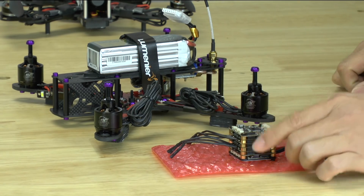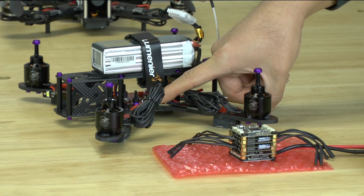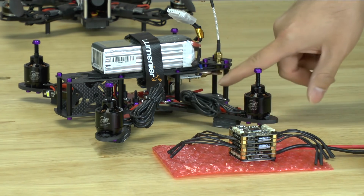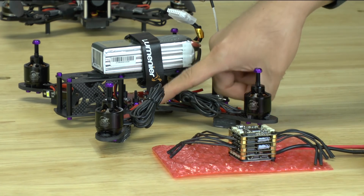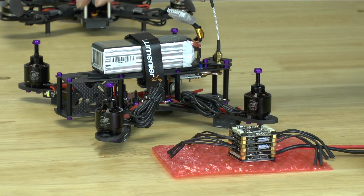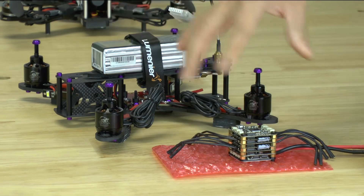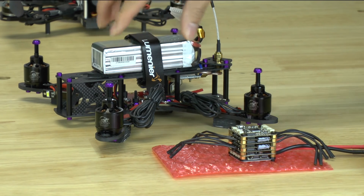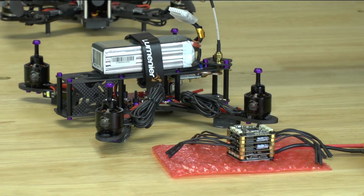We're going to go ahead and put it in this quad and make a few modifications. The 12 volt power — we're actually going to run 12 volt power to this power distribution board. By doing that we have plenty of clean 12 volt power to power things like LEDs and our video transmitters. We're actually not going to use the 5 volt at all. We're going to run the 12 volt to this PDB and then use the power distribution board on the Alien to power everything else we need, since it's running on a 6 cell battery.